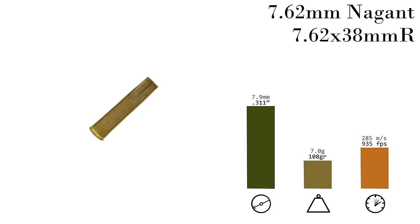You see, the guns were apparently jamming up, the bullets were jumping forward due to the shock of their companions being fired off. This was resolved by setting them a little bit deeper and making them a little flat-faced, and sadly reduced the muzzle velocity slightly. Even so, a crimp had to be added to help further. The end result looked like this, a bullet set way down in the case, now moving at about 935 feet per second, a reduction of 50 from the initial test samples.